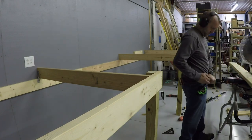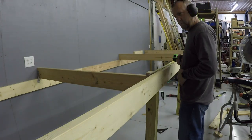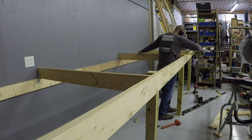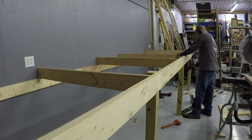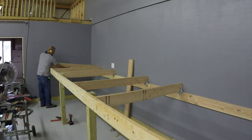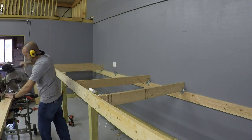Cutting and installing the third and final front support board — so far, everything is lining up nicely. Now I'm going to mark the placement of each floor joist on the front boards and then do the same on the rear ledger board. I measure from the wall to the laser and get the length of the next board and cut it to size. I then revisit a previous board and finalize its length — it was purposely left a little long so it could be trimmed. Now we will start measuring and cutting each board moving down the line, including another previously installed board that needed a slight haircut to make it fit perfectly.